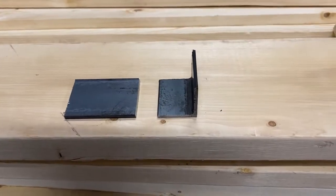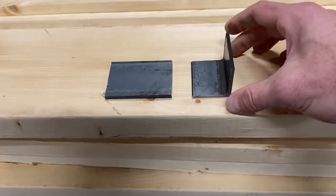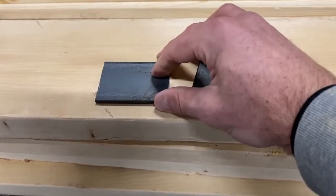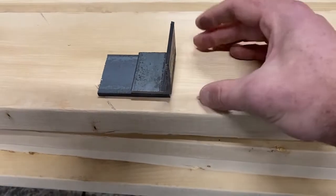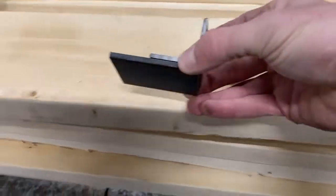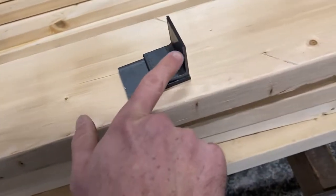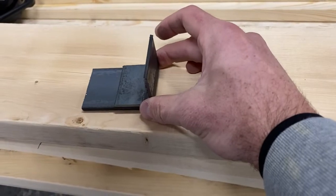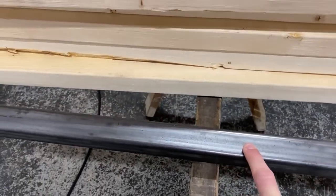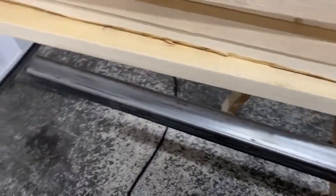To make the side slide rails, I'm using an inch and a half piece of square tube that will slide inside the two-inch pieces I've welded to the bed frame. To secure it to the wall, I need to make a bracket. I've got a steel plate and a piece of angle that I'm going to weld to it - it's two and three-quarters inches long because there's three inches of clearance on each side. I'm going to weld that to the end of my square piece and then screw it into the studs in the wall. I've opted to run the inch and a half square tube all the way down to the floor and secure it there instead, so all the weight will be on the floor rather than just hanging from the wall.